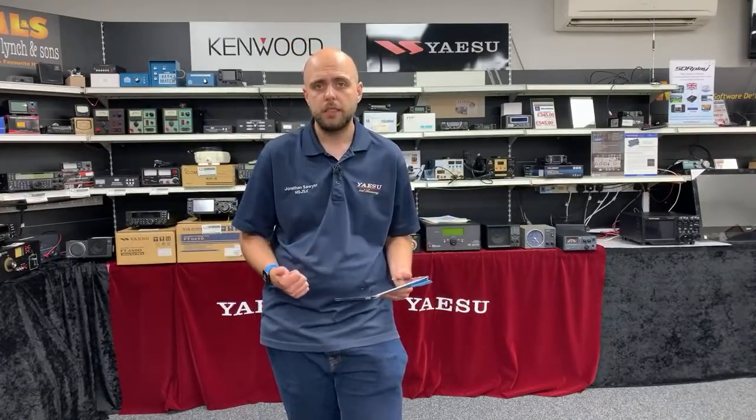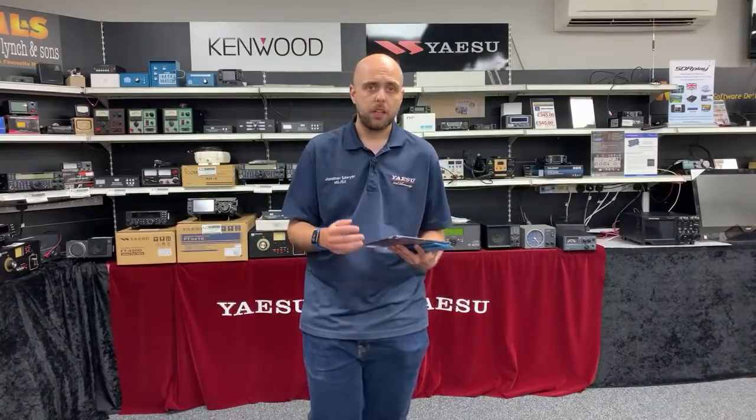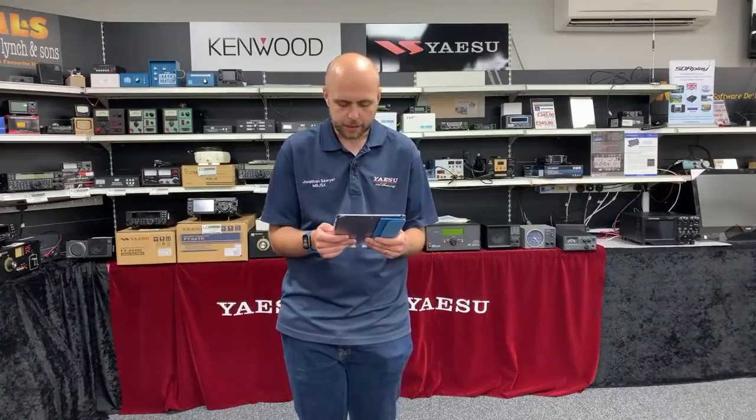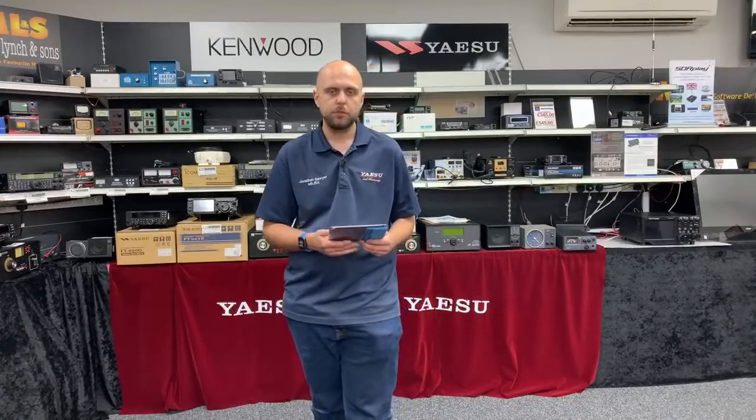SDRPlay is very popular for receiver-only SDRs, but it's not the only option. There's the Kiwi SDR if you want to use one remotely — a good choice. There's also the FunCube dongle, always popular, and the Kerberos SDR — a four-channel RTL SDR system we've only started doing in the last 12 months or so. Great for direction finding. Michael also asks about antennas to use with SDRs — that always comes down to what frequency you want to receive. Generally there's no one-size-fits-all antenna; a discone comes close, but the frequency band you want will always dictate the antenna.